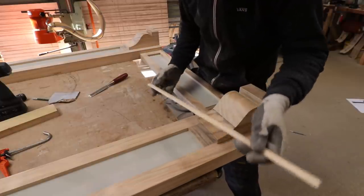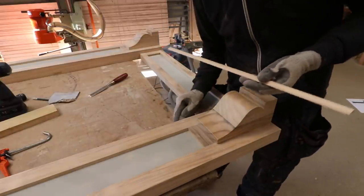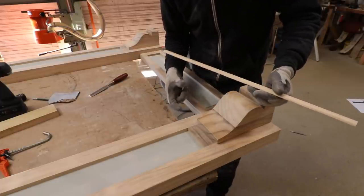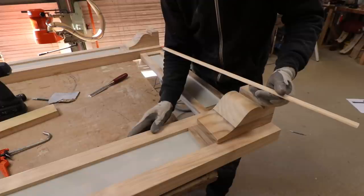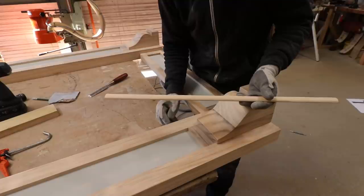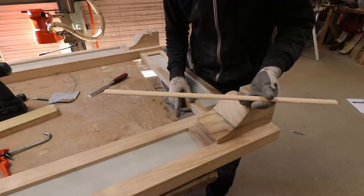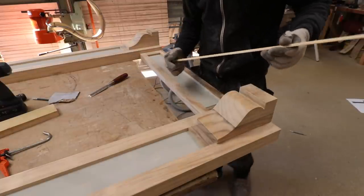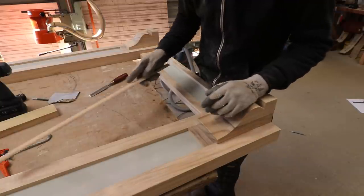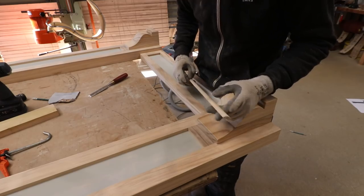So when it's fitted, I'm going to make sure that these run right back to the panelling, then right back into the fireplace, because I'm not quite sure how much extra depth I'm going to need to the fireplace, whether I'm going to have to build these up slightly. So if I can run them back in, it'll look a lot neater than if I do everything flush with this part and then have a gap or anything to the other components in there. So I'm going to cut this on site, and I'll do exactly the same with the sort of the plinth block that joins into the skirting board. I'm going to mitre that round on site as well.